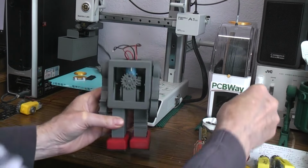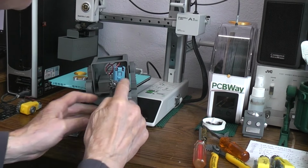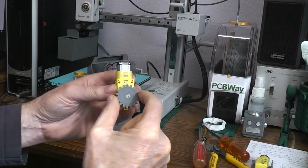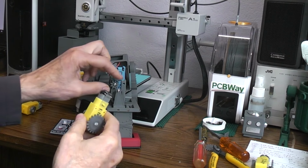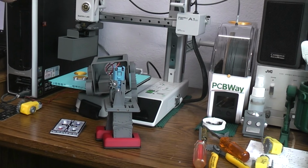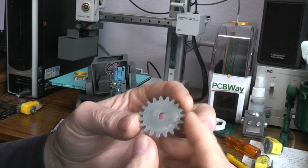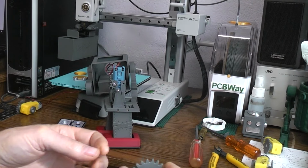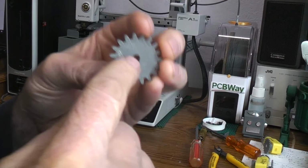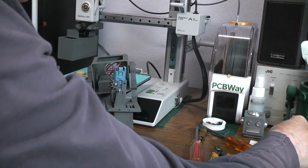Now as far as what the problem was with this gear not lining up, I'm not 100% sure, other than there must be some slight change in the position between these mounting holes and where the shaft is, because this gear seemed to be pushing very tightly up against my idler one and was binding. Anyway, that's the way it appeared to me. And if that was really the case, then I guess what a person would have to do would be to take this gear file, and you might have to reduce it in size slightly. I don't know about how much, because this is all new territory. I hadn't even tried this motor before. But, you know, take it down 2%, 4%, which means you may have to take your X-Acto knife and hone that out until it will fit back onto the motor shaft. But get it small enough so it isn't binding up with that little gear.